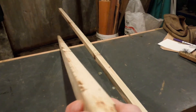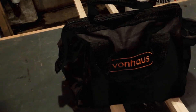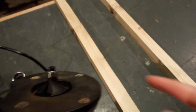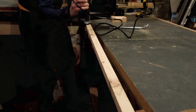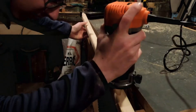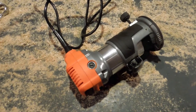So I have two bits ready. This one's the straightest of the two — it's pretty straight but it's kind of square, so I'm going to round over the edges. I'm going to do that with this bad boy — it's a router. We've got a 14mm radius round-over bit, which should be perfect for 29mm stock. It would appear that routing makes a bit of a mess. I could use dust collection, but no.